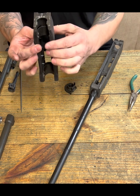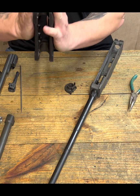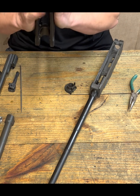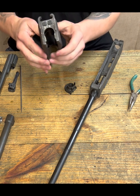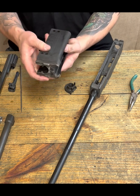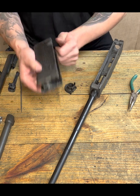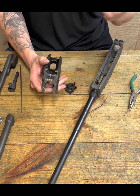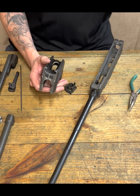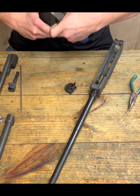because when they made this handguard, they were slightly off, and I'm over exaggerating, but these two pieces, when they were put together, they weren't flat. And what was happening was it was causing an excessive gap. It was damn near 1/8 of an inch of gap in there. And so what I just did, no kidding, with a flat file, I went in and, let's take this out, I'll show you.